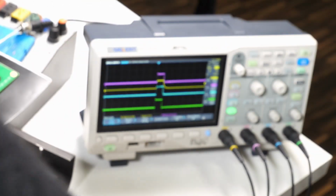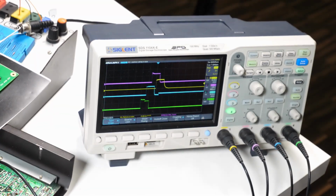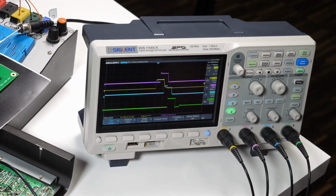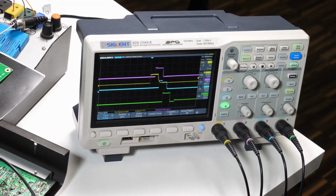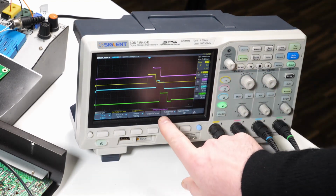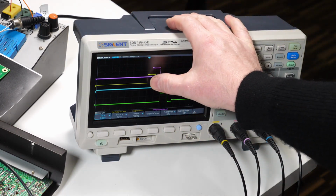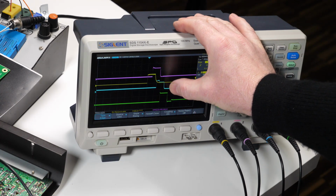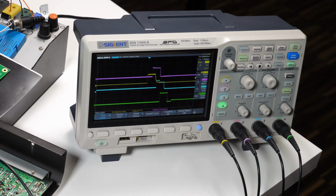Now if I run the external sequencer, what you can see is the pulses are spread out in time. Stop and look at this. You can see in this time base we're looking at 1 millisecond per interval. So you can see there's 2 milliseconds delay between the first note pulse and the second one. They're separated by at least half a millisecond between each pulse, thereabouts.